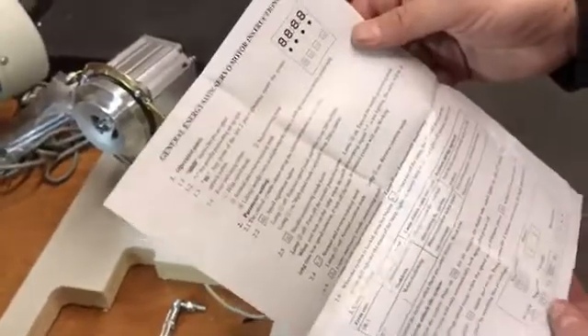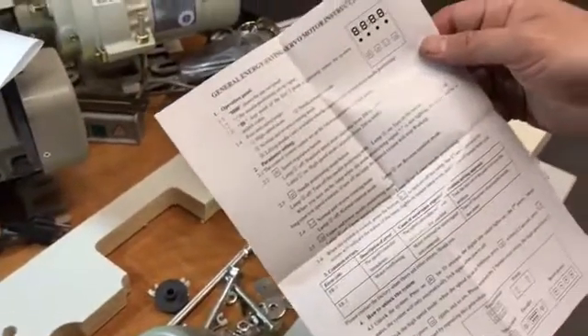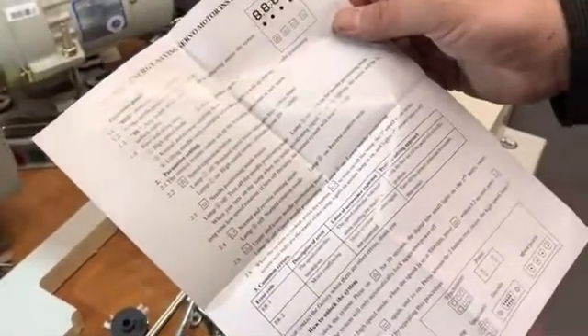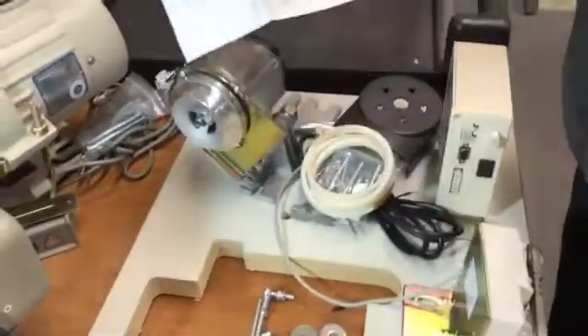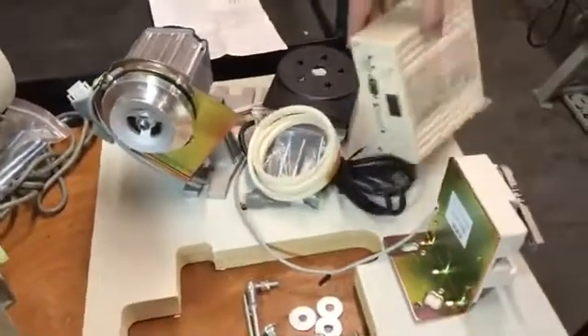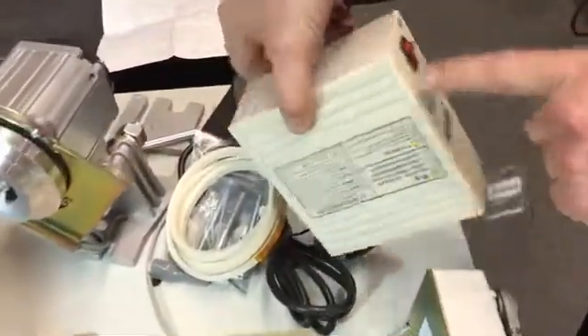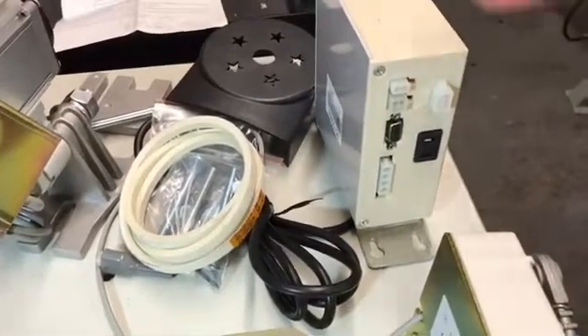This panel box lets you control the speed, set up a synchronizer, power speed control, and motor power. These are the functions available in the back. With the regular servo motor you can only hook up the lamp to it, but with this one you have the on/off switch, terminal box, and needle positioning — everything can be done from here.